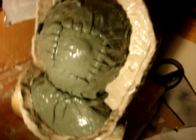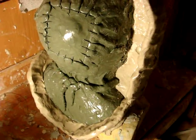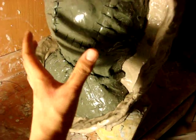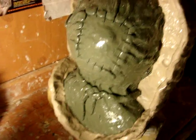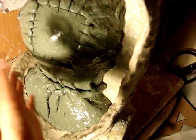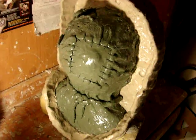That's mold making. Then once you're done with that, you can take off the containing walls. You're gonna rip it out, and you're gonna demold using a hammer, screwdriver, and some chisels. So yeah, I'm actually gonna videotape the final step before I demold it, because I'm basically saying the same thing over and over again if I apply it to the second half of the two-part mold. So yeah, good.